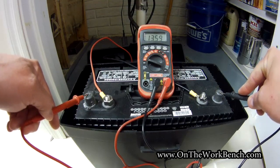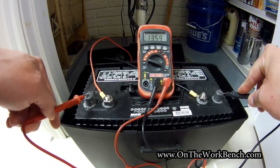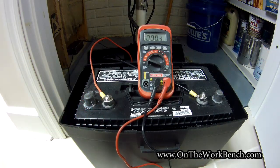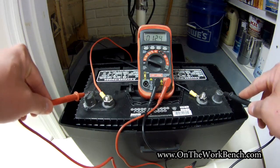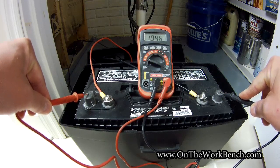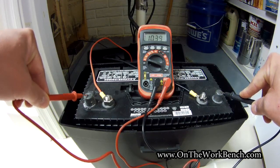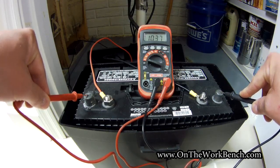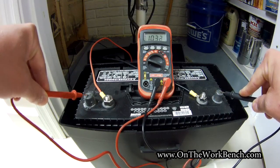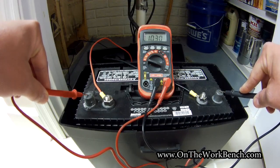But the next step in my diagnostic process needs to be to disable the trickle charger by unplugging it from the wall. Then we're going to recheck the volts and see what we get when this is actually not plugged into the trickle charger. All right, now we've unplugged it. Now we're retesting the battery and now we're getting 10.5 — just under 10.5. This really should be reading about 13.2 on a fully charged 12-volt battery. This is a deep cycle marine battery and it should be reading about 13 volts, so we are not getting that.